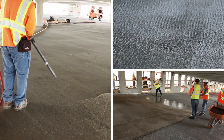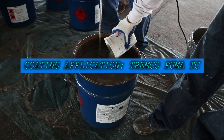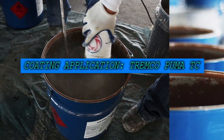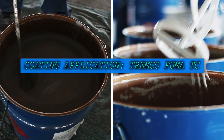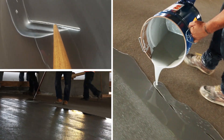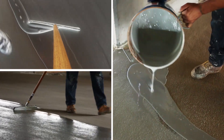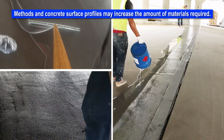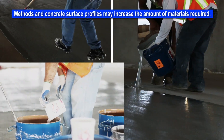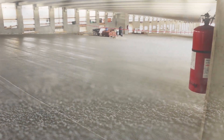Before proceeding with the Tremco Puma TC, sweep or blow off any excess sand. Mix Tremco Puma TC for 2 to 3 minutes prior to adding in the initiator. Tremco Puma TC is then thoroughly mixed together. Apply Tremco Puma TC at 64 to 90 square feet per gallon, 0.43 millimeters thick, to the entire area. The recommended method of application is with a roller. Note, recommended coverage rates are approximate. Sand loading methods and concrete surface profiles may increase the amount of material required to obtain uniform coverage. Allow Tremco Puma TC a minimum of 1 hour to cure before opening to vehicular traffic.